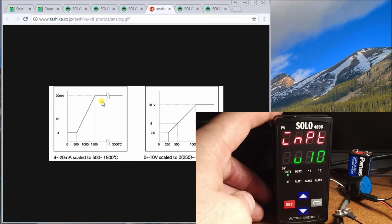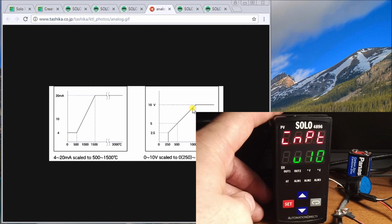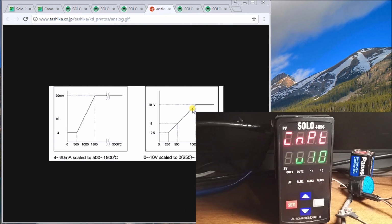So basically what I'm doing is I'm going to treat this, we can feed it any analog input. We have a 0 to 10 right now, and on my 0 to 10 volts signal, what I'm doing is I'm going to set my min and my max, and then that will draw a straight line for me. What that does is it will scale that input for me in order for me to read what's actually happening in the field. So in our case here, we're going to go 0 to 10 volt battery, or 0 to 9 volt battery. We're going to scale it so that we go 0.00 to 9.00, or whatever the battery is going to produce for us.